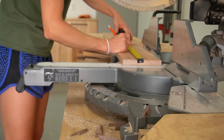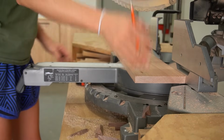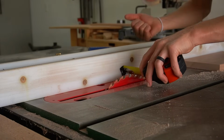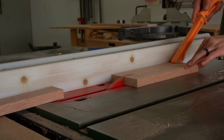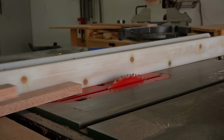At this point, the cookbook stand handle has been cut, drilled, and sanded, and next I needed to add the book ledge. For this, I trimmed a piece of my 1x6 board to about 10 inches long and ripped it into 1.5 inch wide strips. If you don't have a table saw, you could use pre-cut 1x2s for this part instead.